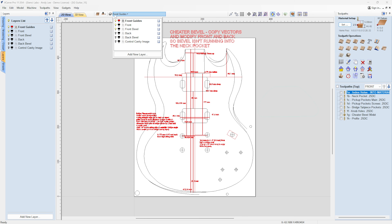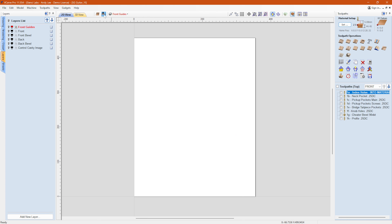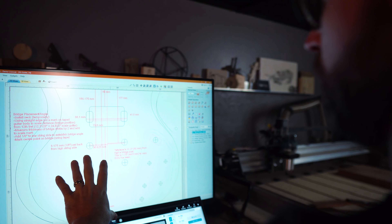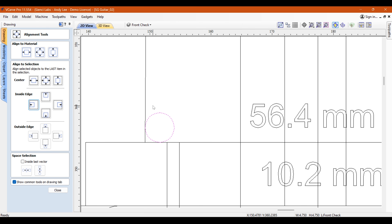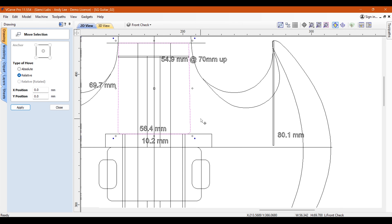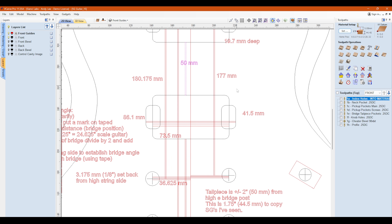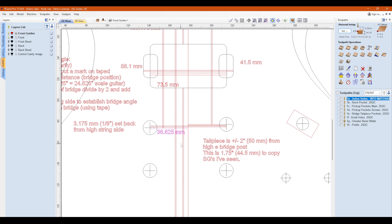It still works and you get to see the front and the back line up properly. Pay attention to your Z0 and your flip orientation in your setup so there are no surprises. I'd recommend getting used to sheets or layers within your CAD/CAM software — they come in super handy when organizing your vectors. Import your vectors into V-Carve, place the front vectors on the front side and the back on the back. The plans you have will likely need modification to accommodate the measurements of your actual on-hand parts — you'll have to measure them and transfer their size, shape, location, and depths when you create the tool paths.